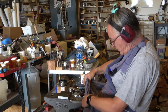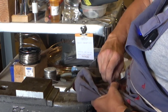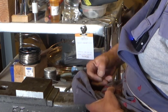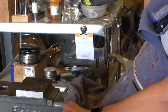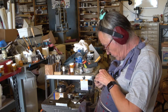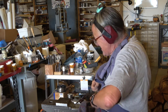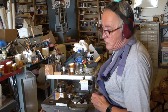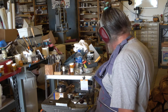Oh, in case you're wondering what this is — it's not blood. That is casting wax. When you fill your molds with wax for lost wax casting, this particular type of wax is red. If the mold slips when you're filling it, it sprays down the front of your apron — which is why you wear an apron. This wax is about 120 degrees, and when it hits your t-shirt it will soak through immediately and it hurts. Some of us learn a little slower than others, but some of us do learn.